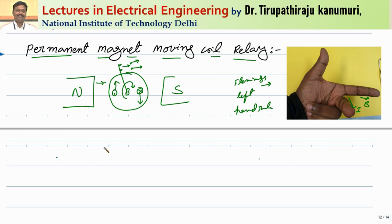The direction of the force is given by F = B × I × L × N, where B is the flux density, I is the current, L is the length of the conductor lying inside the magnetic field, and N is the number of turns. So this will be equal to BILn. This much force is produced, because of that it will start rotating. This is the basic working principle.